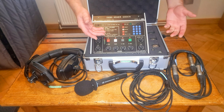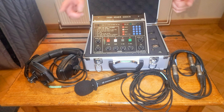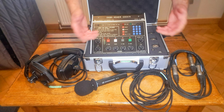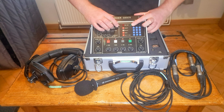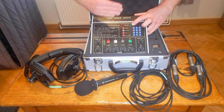The way it works is that just like a telephone, you dial into a number using the keypad here, and once you connect to your relevant broadcaster and their studio or hub, these two lights come on. The red one comes on first, then the green one — the codec — and that's really important because both of these need to be solid for you to have a solid connection. If this one is flickering, you haven't got a solid connection and you will be ducking in and out.